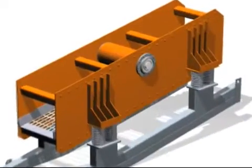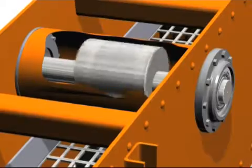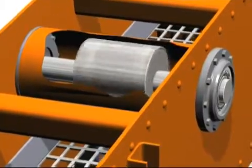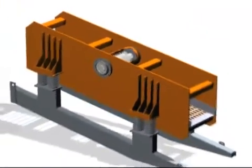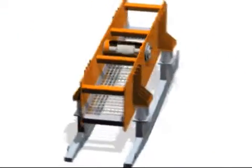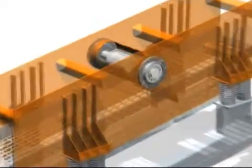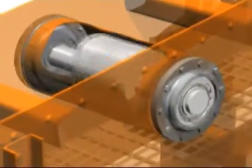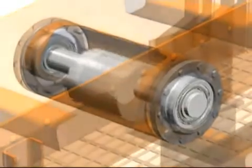In the mining, mineral processing, and cement industries, the vibrating screen is used to sort and clean materials. Held up by springs or other flexible supports at the corners, the frame often features a rotating shaft with an eccentric mass. The rotation of this mass produces unbalanced forces that cause the screen to vibrate, but it also produces high acceleration forces on the support bearings.